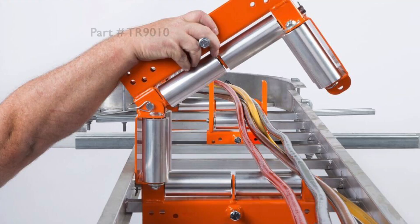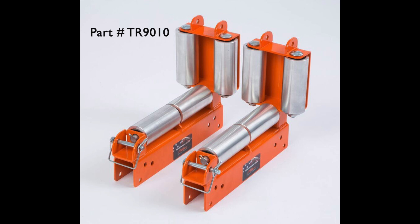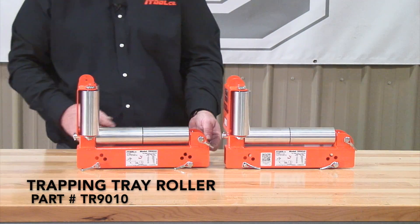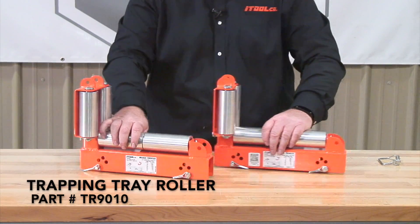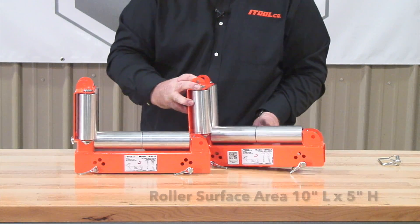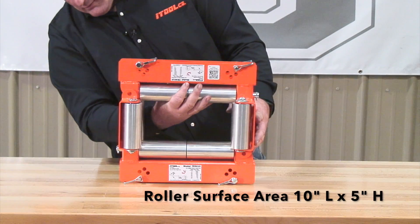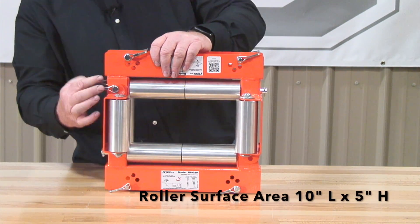Our trapping rollers also use the drop-over bolt-on design — great for trapping conductors going around 90s or offsets, and changes in elevation up or down. Let's take a quick look to see how they work. The trapping roller features four solid aluminum rollers with rated bearings. These are fantastic for going around corners and offsets. Say we were going around a 24-inch radius: we'd set these up, install our strut where needed — maybe three as shown — then set them back up to perform a trapping function for changes in elevation. We would simply line these up, install our locking underpin, and be ready to make a wire pull.